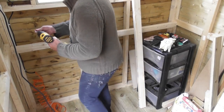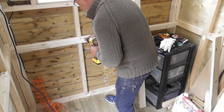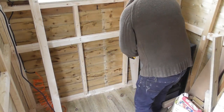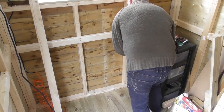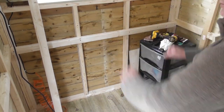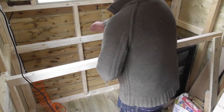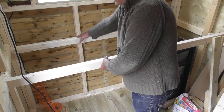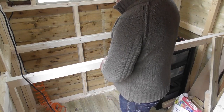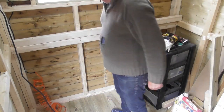Let me pull that piece of timber out of the way. The back wall's quite flat — it pulled in a couple of millimetres. So that rear bar is the rear support for the worktop, and as you can imagine there's going to be another one at the front. I need to trim this one a little bit — probably about 550mm from the back edge, it being a 600mm worktop. So I'll mark a line at 550mm. I'm probably going to have to clamp this in position and then make some support legs for it, building a bit of a support underneath before I fit the worktop.